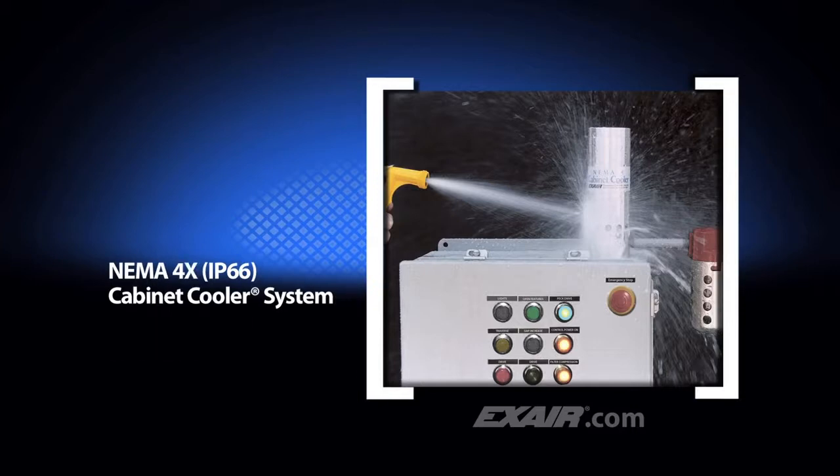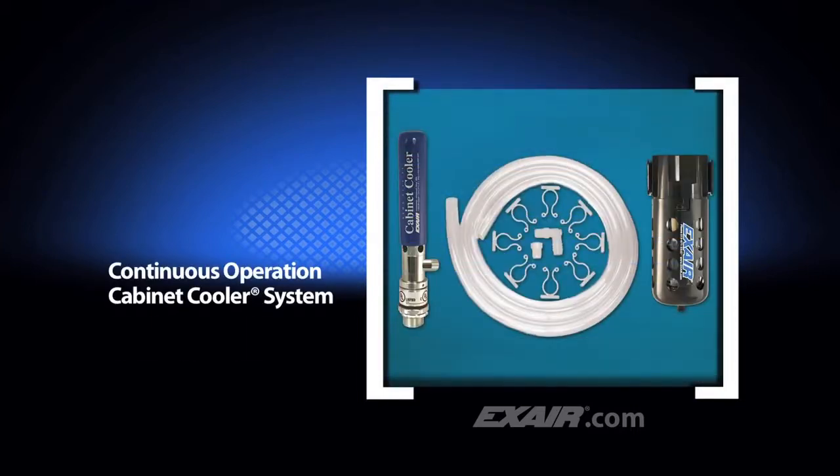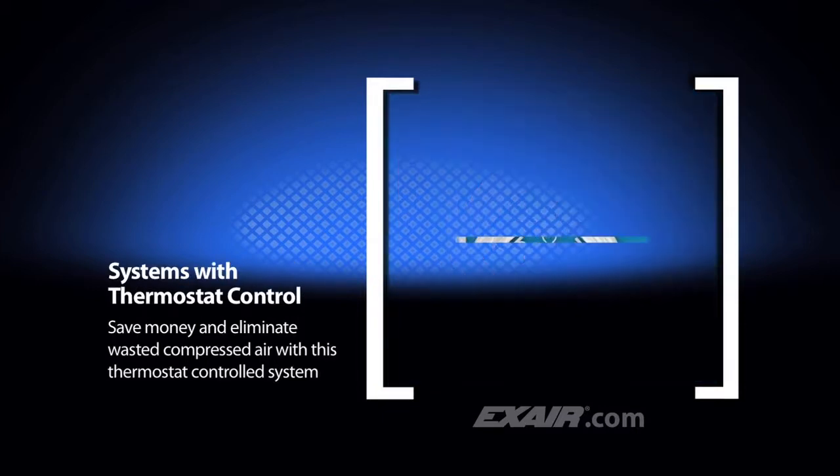NEMA 4X or IP66 cabinet coolers look identical to NEMA 4 and they offer the same level of protection, but they are constructed of stainless steel for food service and corrosive environments. Cabinet cooler systems for continuous operation are recommended when constant cooling is needed or a positive purge is desired.